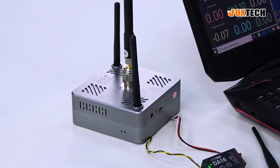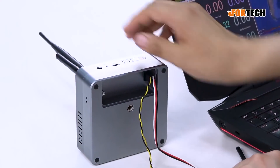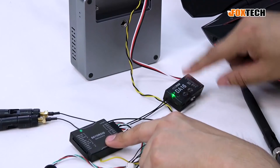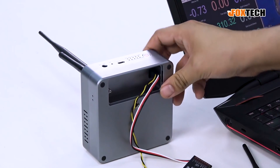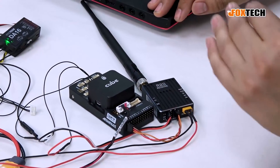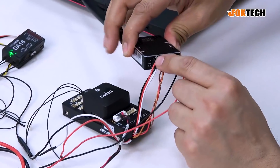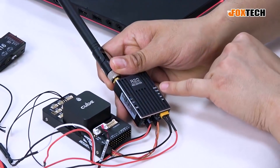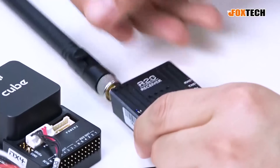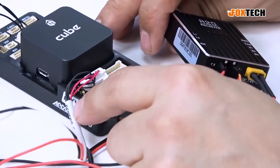Let's see — we have everything already arranged. We have the two radio receivers connected to the D04, and you can see they connect via the S-BUS output. Both radio receivers have the S-BUS output connected directly to the bottom port of the D04. On the plane side, we have the Pixhawk 2.1. We have the tele port connected to the UART port on the R20 receiver. You can see both the RXD and TXD LEDs are flashing, meaning it has data input and output at the same time, and power works great. Then we have one channel of S-BUS connected to the Pixhawk RCIN.